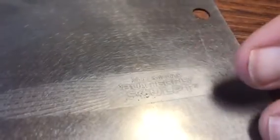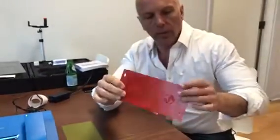That's 25 microns deep — a thousandth of an inch deep, plus or minus a little bit. That's for the basic one, but if you move to a photopolymer plate and you put a line screen into the plate, the etch has to be deeper so that it gives you enough ink volume.